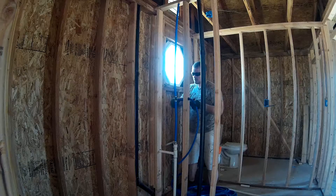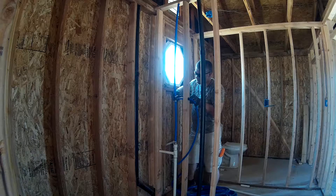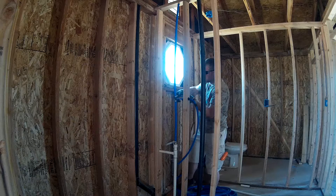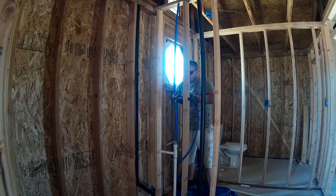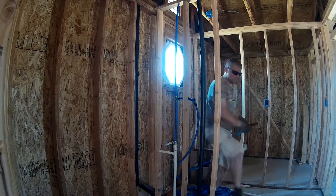Now this crimper I had — it had three little handles technically. I had the two that you pulled together, but there was a second one in the middle because it ends up being a huge wide handle for tightening. So use the small one in the middle plus one side to tighten it first, and then once it gets closer you can use both sides to tighten it up the rest of the way.